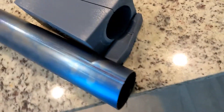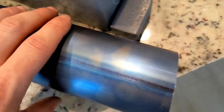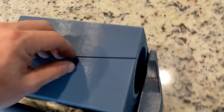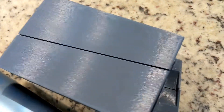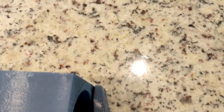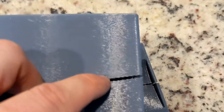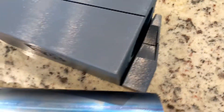You don't need to mark on your pipe or anything like that — no more having to chase 180 degree marks and trying to get it perfect. You already have a mark on your pipe; it's perfect already. Use your weld seam — that's what I intended this fixture for. It's 3.03 inches ID, and I take off 0.05 inch on the face in the program, so when this is fully closed it's basically a 16th of an inch gap, perfectly centered on the pipe. You can use that directly on your weld seam for lining up your 180 degree marks.